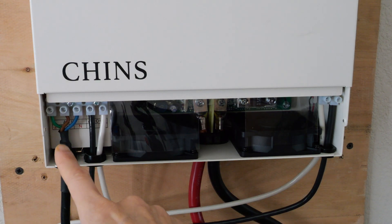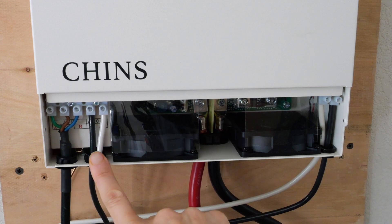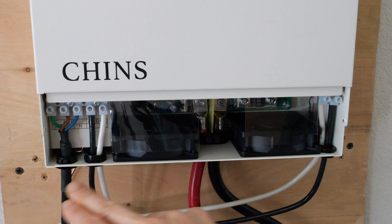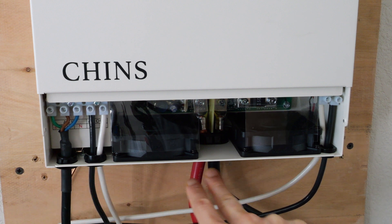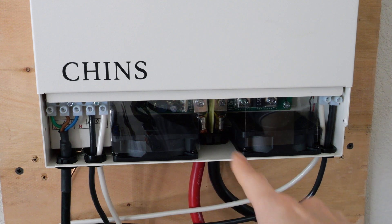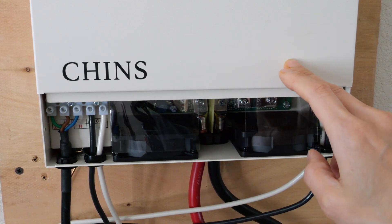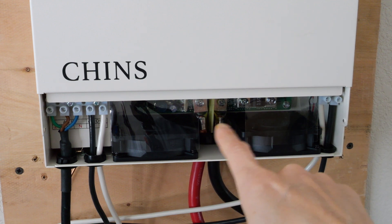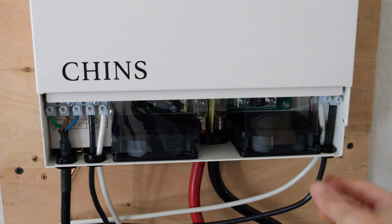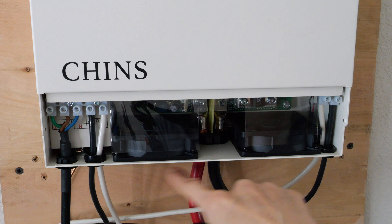I have slightly smaller cable here because I only plan to do up to 20 amps charging. There's an 8-gauge output here and 8-gauge input for the solar. These wires are not included — you have to supply them yourself. These two cables down here are 2-gauge cables I had to buy myself. But those connectors you see in there are supplied by this unit, including the two bolts that bolt into the device. So when you buy these cables, make sure you buy 8-gauge wires and also 2-gauge wires for the battery.